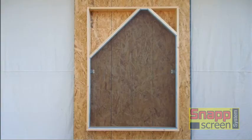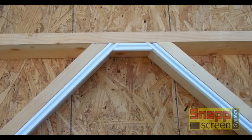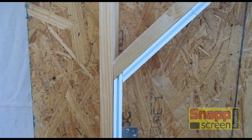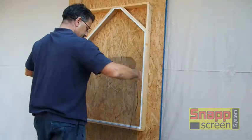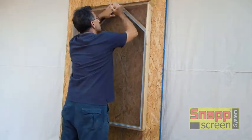We've added another leg to create our six-sided opening. Where this would be most common is a gable end on a porch — you'll run into a six-side; it won't look exactly like this, but pretty close. We want to show you how we handle the angles, especially up top with a double angle so close together. If you notice, both sides — we actually overlap the extrusion differently on each side. You may have to go back to make note of it, but we did that just to show the versatility of the product.